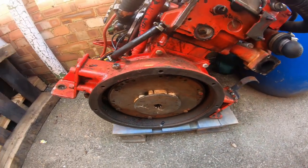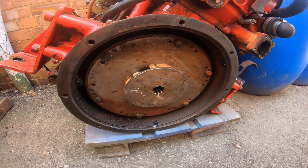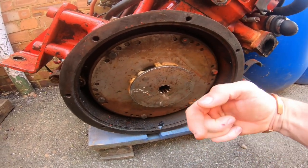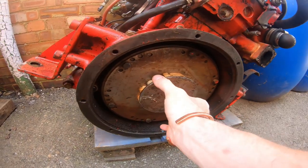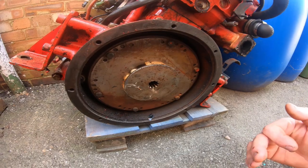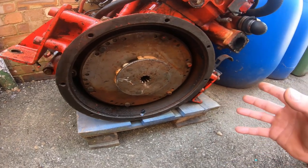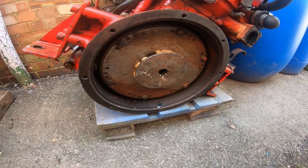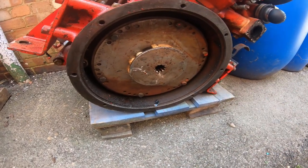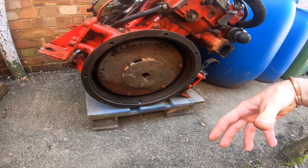With this older engine you have a solid mass. This is your drive plate — the outer diameter is bolted solidly to the flywheel with a number of bolts, and the centre hub is floating. It's fixed to the back plate but has a circlip so it can only spin so much. The idea is that these absorb torsional forces. On a marine gearbox, the engine is always running — you're not stopping it to start — so when you engage ahead or astern you're trying to move stationary mass: your prop shaft and propeller. That's all heavy stuff and it's going to jolt aggressively.